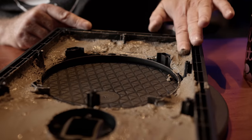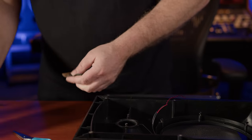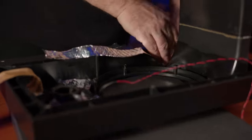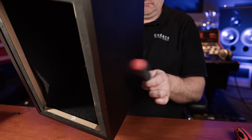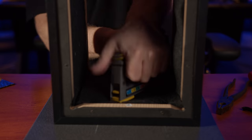With the Adam T8V we filled the front panels with cement and achieved a much better monitor for very little additional outlay but a messy load of effort, so we dived into the comments to see what our viewers suggested. Most suggested self-adhesive heavy acoustic damping material, as popular with the in-car audio fraternity. So onto Amazon I went, and the next day set about lining — and therefore adding mass to — that plastic front panel. Whilst doing that I could also hear clear resonance in the standard thin MDF box. Experience has taught me that generally the more inert a cabinet is the better, and as we had more than enough damping material to treat both cabinets, I was interested to hear what difference this would make.